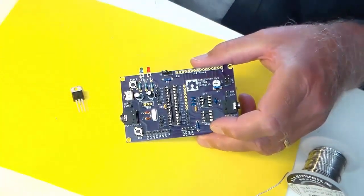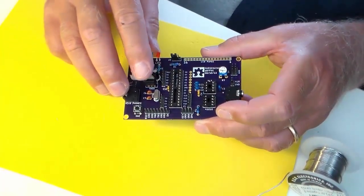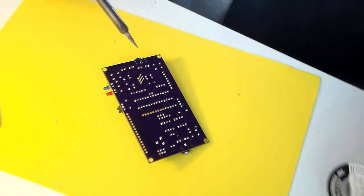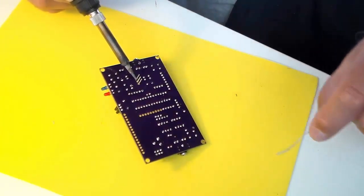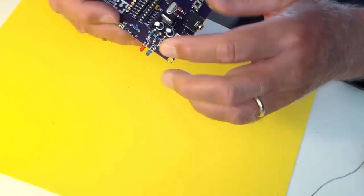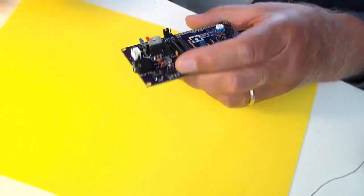This is the 5-volt voltage regulator. It's got a little tab on it — kind of a heat sink — and it's polarized too. That tab has to line up with the stripes on the silkscreen. I'll solder just one pin, which gives me a chance to bend the component a little bit — I like to see them stand straight up. Notice that the heat sink will be facing the LEDs. That's important.